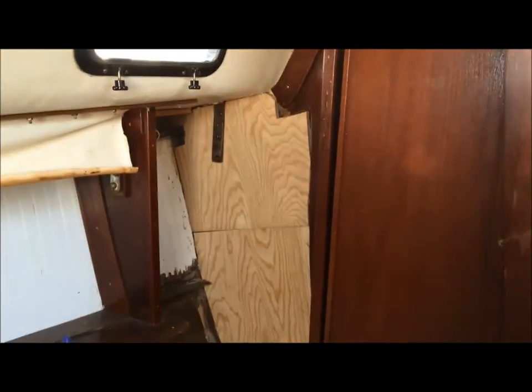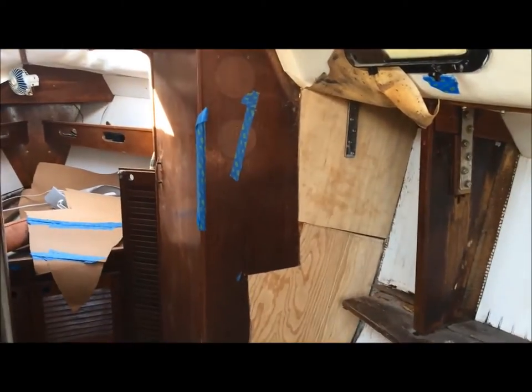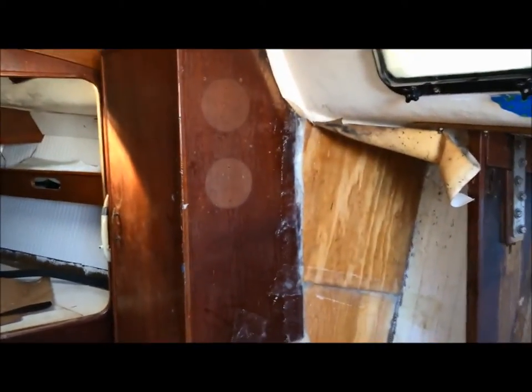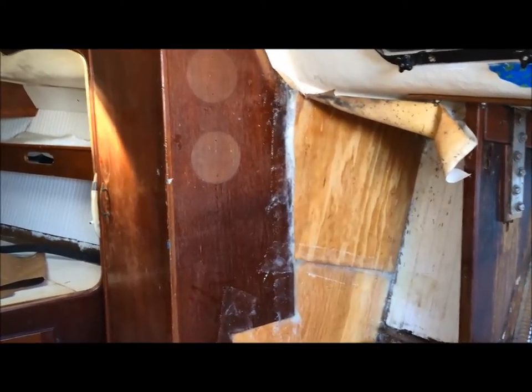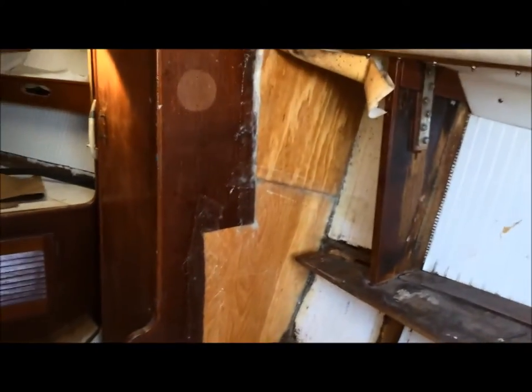So I'm very happy. There's about two, maybe three weeks of work. Here on the 17th of January, we're starting the glassing in of the hole. I'm not looking very pretty right now, but this is all for structure so that rigging can hold tight. I'm going to basically glass over the whole bulkhead and paint it. There's no sense in trying to get the wood grain out when everything's so different. After about three layers of fiberglass cloth, we'll smooth that out to one solid piece, and obviously a lot of fairing will smooth it out. We're going to let this sit for a week and see how it does.